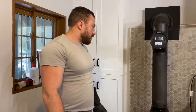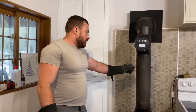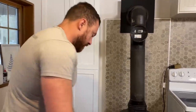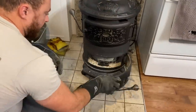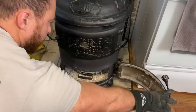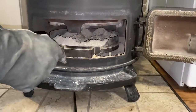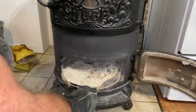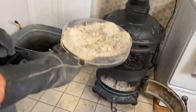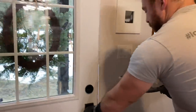The best part is you only have to spend about five minutes every 12 hours servicing this stove, and that's what I'm about to do now. The first step is to open the turn damper here in the stove pipe, then open this bottom door and remove the ash pan, which has the ash from the previous 12 hours of burning. There's some building up in the bottom I'll have to clean soon, but for now I'll just take out the ash pan and dump it outside.